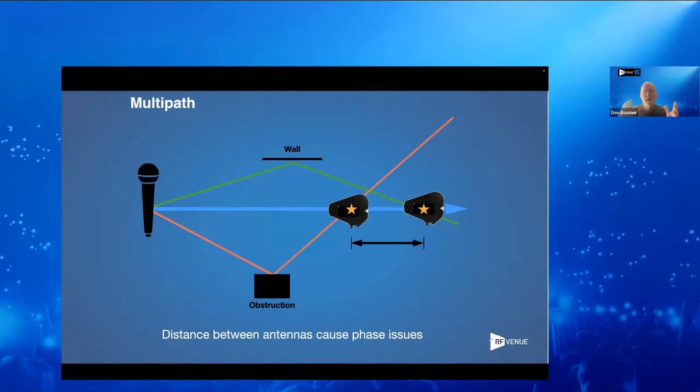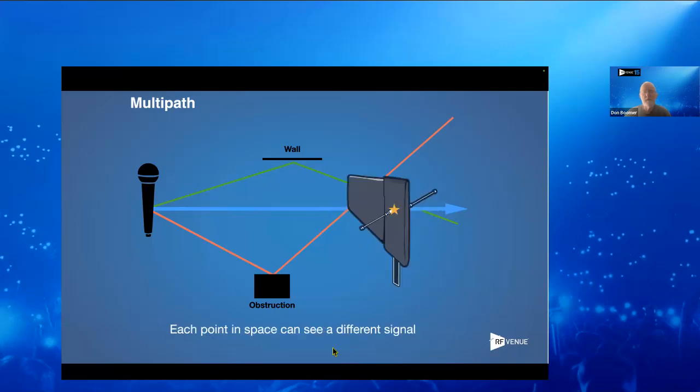If we stop time, there's going to be a time where having them in two different directions is actually worse because they're separated. If they weren't separated, it would just simply be one or the other. It's very simple. The antenna just takes care of it. But when you add the distance is what causes us the grief, right? Because that's phase. Phase just means time. So there's no phase difference between these two antennas. Whatever signal you dump on them, they both see exactly the same signal. And then we're talking about amplitude changes based on polarization, but not the signal itself.